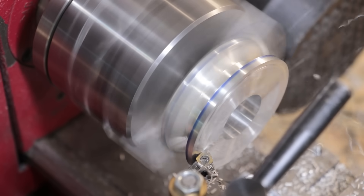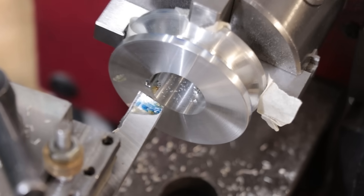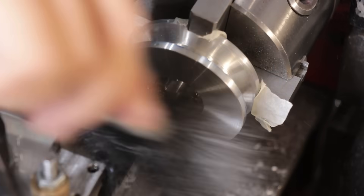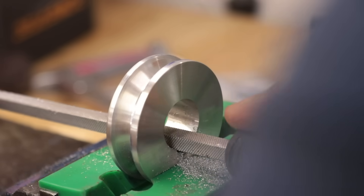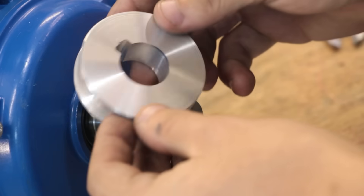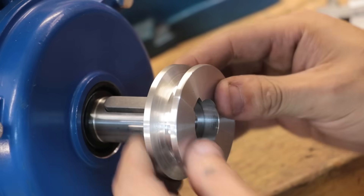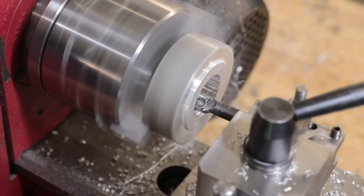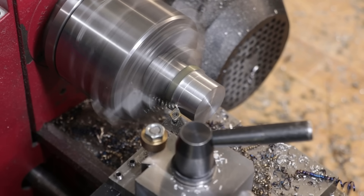With the first pulley now parted, I can clean it up and get started machining a keyway. I was going to use the carriage to act as a shaper and cut the keyway that way — I've done it several times before with gears and it works fine — but with this size keyway it was taking too long. So instead I did it the old fashioned way, by hand using a file. That is a pretty good fit. I also machined up the other pulley to fit on the spindle. There wasn't much material to hold onto, so I had to hold it using an arbor and some super glue.